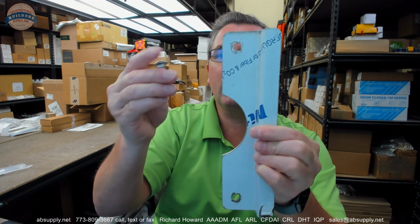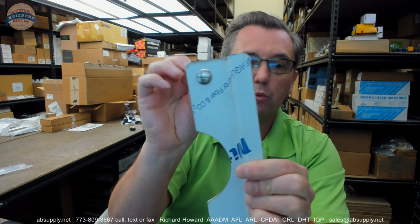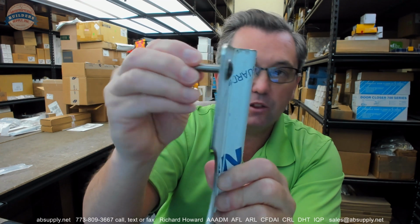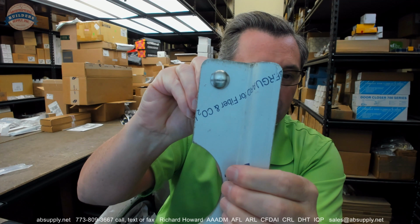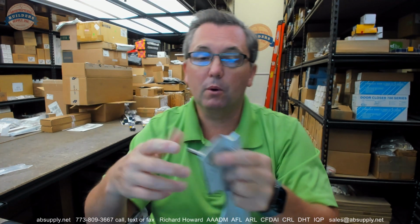As you can tell here, there are two preparations for bolts. Those square preps would take a carriage bolt naturally. And the carriage bolt is really great for this because of that square prep and the square feature underside the bolt will not allow that to spin. And there's nothing out there really to attack. I suppose if you took a grinder to the head of that bolt, but people breaking in or removing latch protectors aren't walking around with grinders that I've ever heard of.